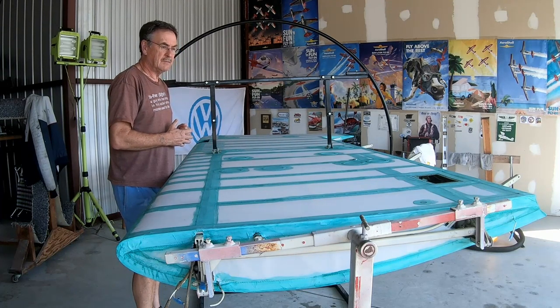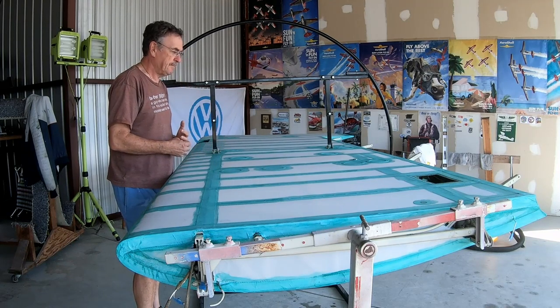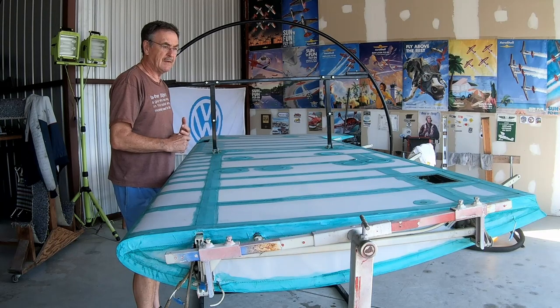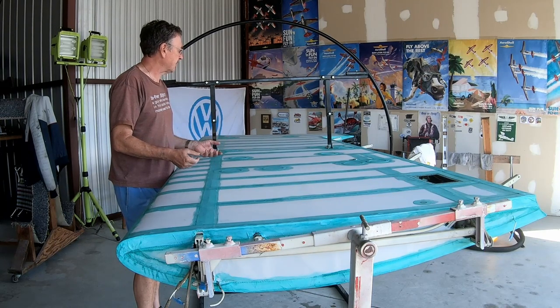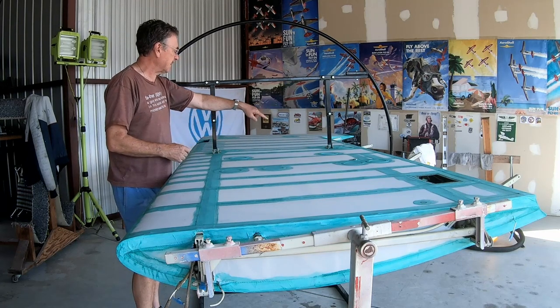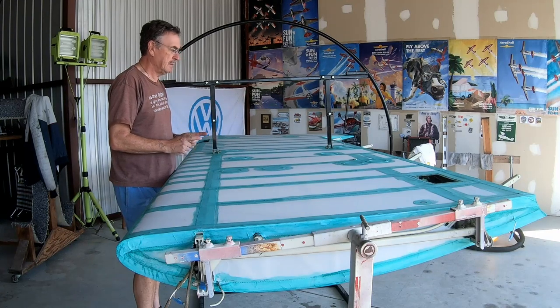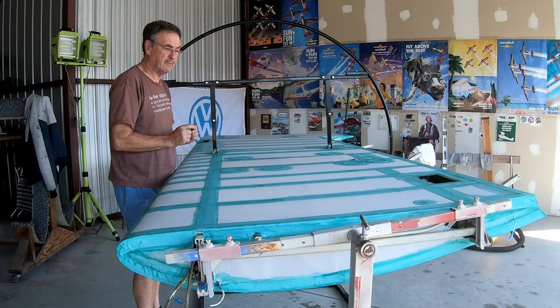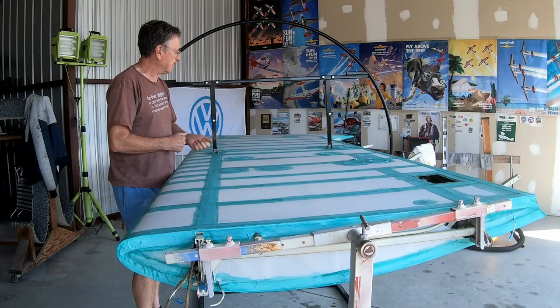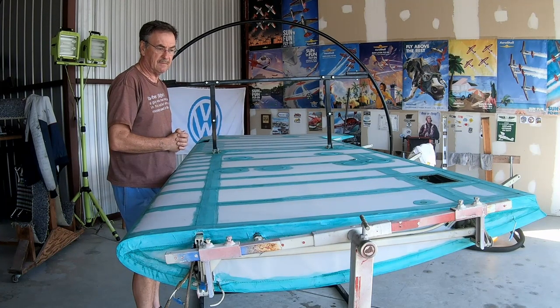And so I just want to show one side of the wing tip, and then I can work on the wing tip. And later this afternoon, a friend will come by to help me take the wing off the rotisserie, so I can put the aileron on, so I can cut the final hole for the cable, where the cables come through, and put the little fairings on that I actually made myself out of thin aluminum, where the cables come out. And then I'm basically ready to bring the wing home and start painting.